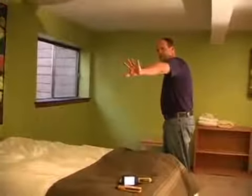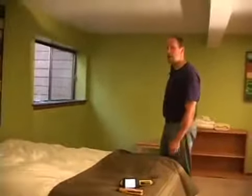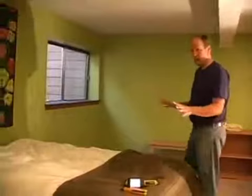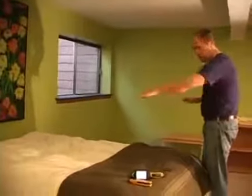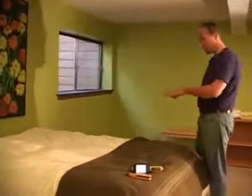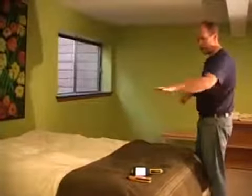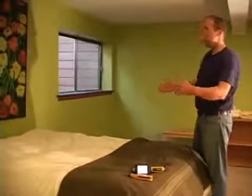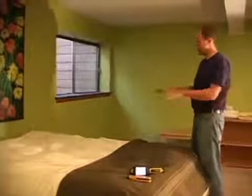That's an exterior wall over there. This is a shared wall with the neighbor — I'm not too concerned about moisture going over here, but I'll take a look at it anyway. The areas that I look for are the bottom corners where the baseboards are. I'm looking for watermarks and stains in the carpeting. I'm not going to move this bed — wish I could pull it out, maybe I will if I see something.